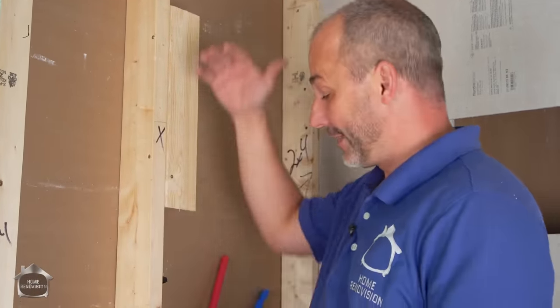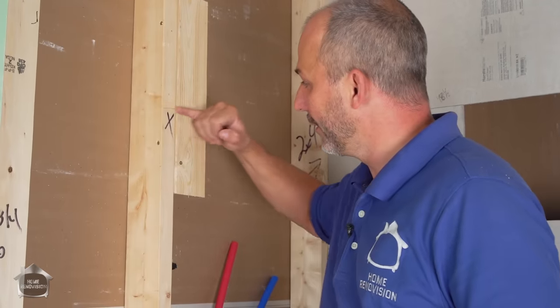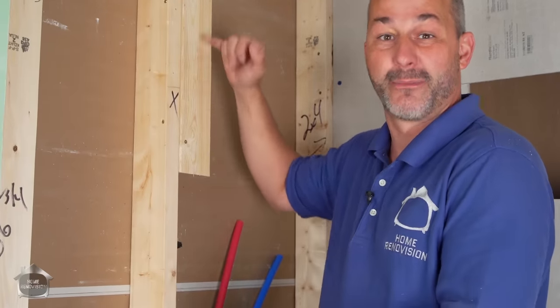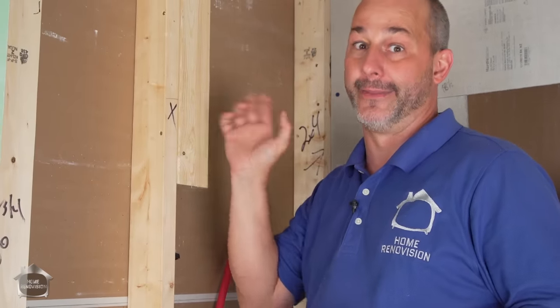Most of these shower towers have a very similar installation. The locations where the water comes out and where the mounts go are going to be unique to each tower. And depending on the person and what features they want, you might have it set higher or lower. So by putting in this large block, even though my mounting plate goes right here, I have flexibility down the road in case I go with a shorter system or the mounting blocks are in a different location. I don't want to just attach this through a screw to a plug in the tile.